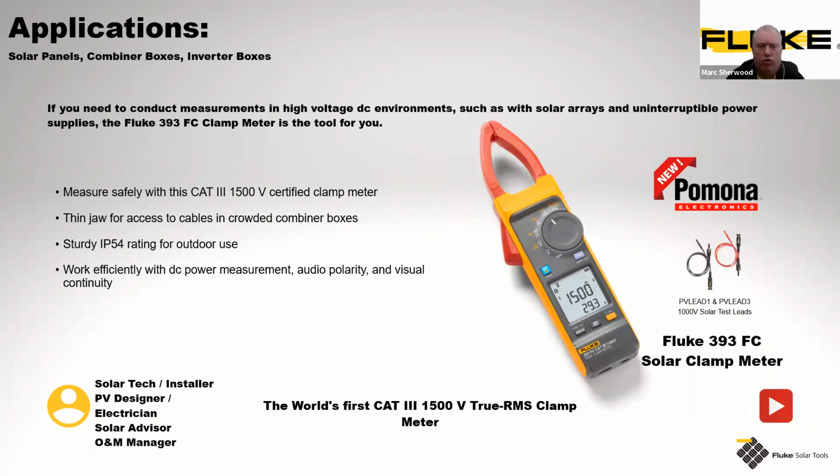It's got a large thin jaw, as you can see. It's IP54 rated. It captures the DC power measurements, as well as polarity with an audible tone and a visual continuity indication as well. It comes with all the relevant Pomona adapters for connecting to the solar systems. So it's a one-stop tool, basically, a complete functional operational clamp to use and capture the data.